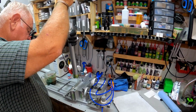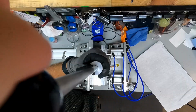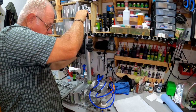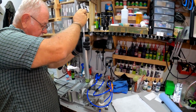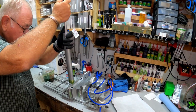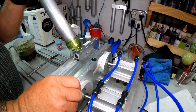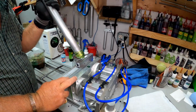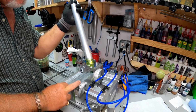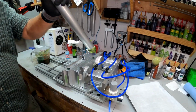We're going to remove our injector. We're going to top it off, make sure that it's full. I'm going to shoot the Beaver over here. Oh, it's in the way of the camera. We got that full. We're holding pressure. Be sure it fills out good. We're going to remove it and top it off. And as you notice, the Dream Shot is sucked down a little bit. Not much, so we're going to keep that on. If you watch this, it's going to slowly draw down as the plastic is cooling inside there. And you don't want to let it draw down too much because you might get air bubbles in your bait. So we're going to top that off some more. Be sure we got plenty on there. And we got the first run done.